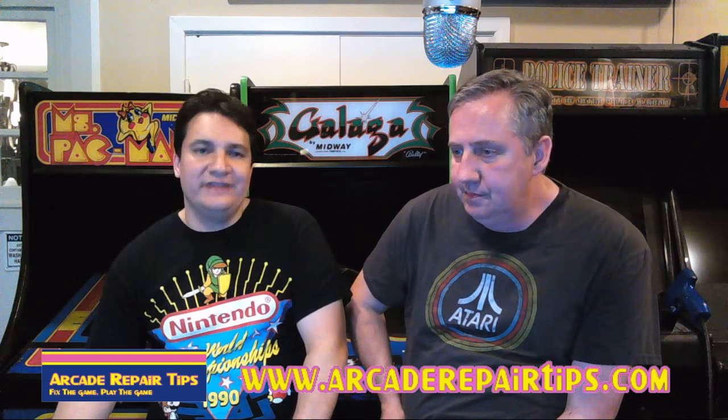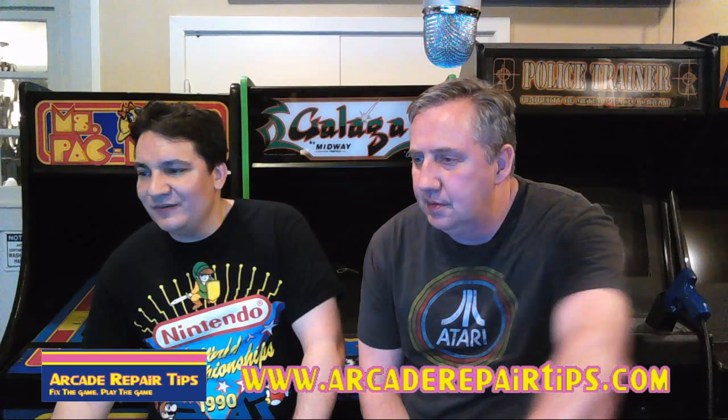In Pac-Man's, Tim, we've talked about the fuse holder. Actually, a bad fuse holder can cause that kind of thing. Just to let you know, it depends on the game, but a lot of times it's going to be a grounding issue of some sort. Let's see what else. More comments.